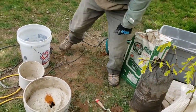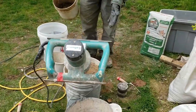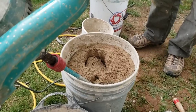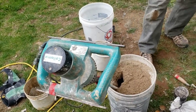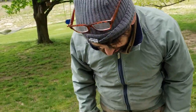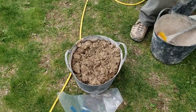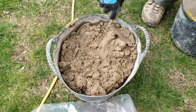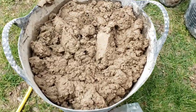We dry mix all of this. The materials have been mixed dry and you can't see any large chunks or patterns of lime, pigment, or sand in there. NHL 5 is a mortar that sets up pretty quickly — it has a lot of hydraulicity, a strong hydraulic set to it, and a little bit of a shorter working time than our previous mortar mix. Here's what it looks like when it's done. This one is a little on the dry side, but you can basically see it in there. This will be good for laying up some stone around a window that used to have brick around it.